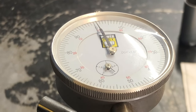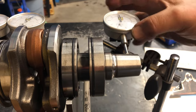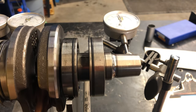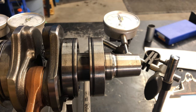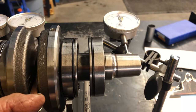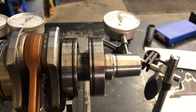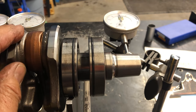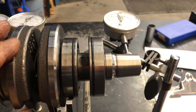One adjustment can affect all the other adjustments, so let's check the center gauges — barely moving the needle, maybe a quarter thou. Now the PTO end is a little less than a thou and a quarter. Going through the same process on the PTO end: pin at the top, zero it, then pin at the bottom — one thou off, so there's a little twist. Checking the spread: very little. So this one is just a little skewed. The high reading is with pin at top — a thou and a half.